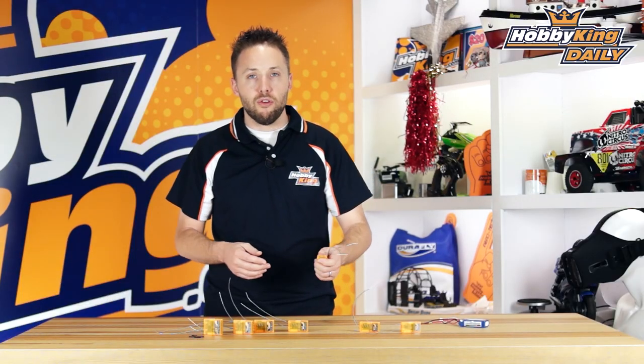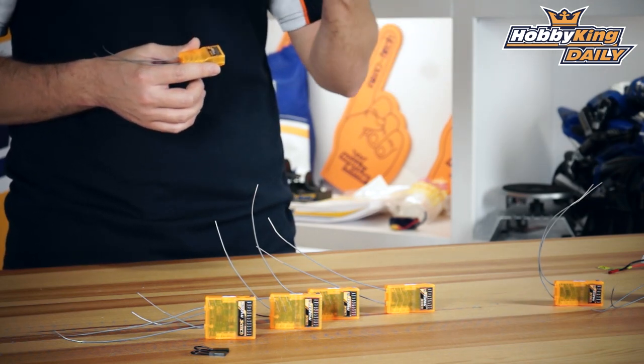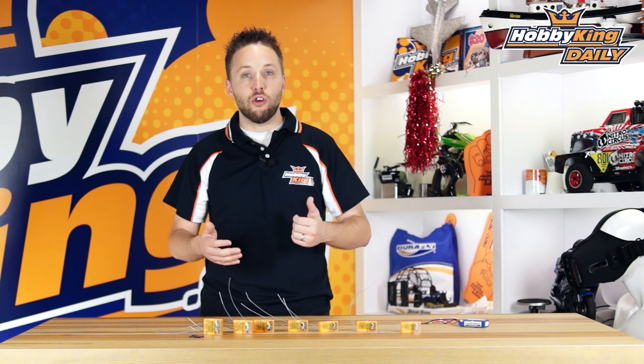What most guys do when flying models with telemetry is simply fly the model within 400 meters of themselves when they want to check something like battery voltage — you'll instantly have that telemetry connection and receive an update on your radio on the current telemetry status. That's the telemetry range at up to 400 meters. Now the RF signal range for control is actually up to 2 kilometers, and that's for the full range from the 6 channel all the way up to the 12 channel — very long range, and something you won't find on just about any other DSM2 or DSMX capable receiver on the market today.